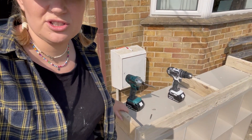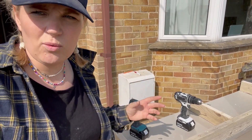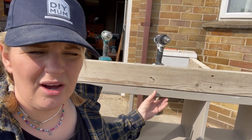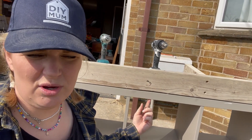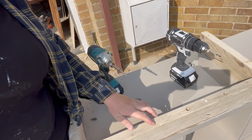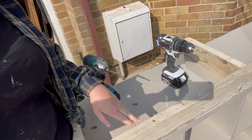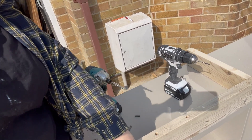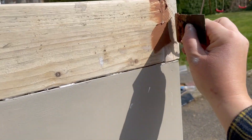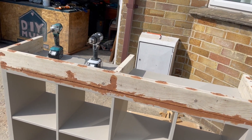I've put the dowels in the side pieces just to align it, and glued the base together. My original plan was to go up from underneath with screws, but the units are pretty much hollow. So instead I've gone through a pilot hole with a very long screw through the wood, which goes through into the Kallax unit — far enough to catch, but not so far it hits the hollow section. It's not going anywhere. I'll fill around the gaps and where the screws are, sand it, then wax that part.